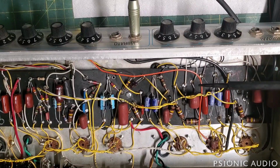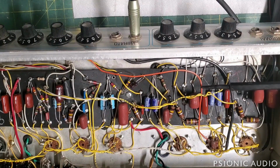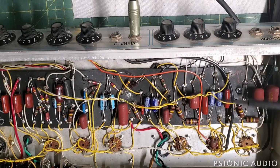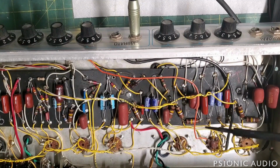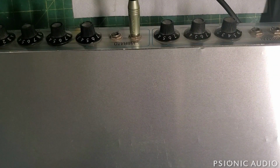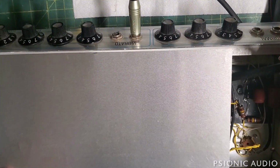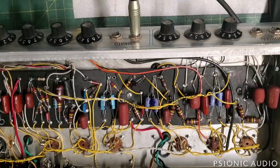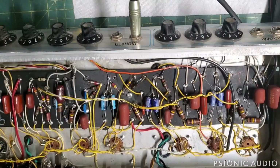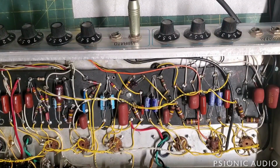But as you can hear here with this grid wire, if it's up against the B plus, there's some noise. If I lower it, it goes down. So that's self noise based on the position of this wire, put there where it's noisiest. Even with the shielding in place, it is best when it's down low. So if it wasn't microphonic, if it was just subject to noise, I could just make sure this wire can't move. But given that it's microphonic as well as being subject to moving, it will earn that shield.